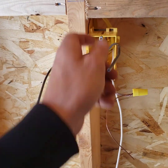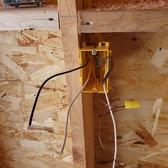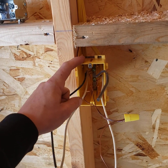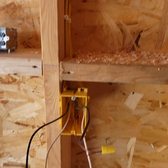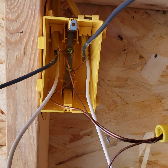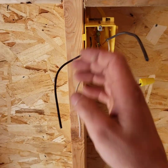The larger your wire size, the less wires you can hold, so I had to get bigger boxes before my inspection. I bought the handy pack first but they weren't going to work. These bigger ones were only about two bucks a box, fairly sturdy, with two nice grounding tabs.